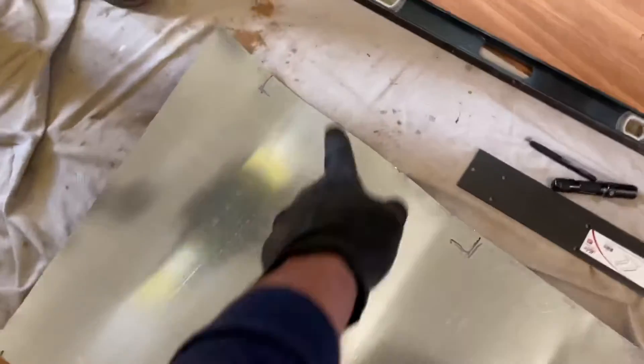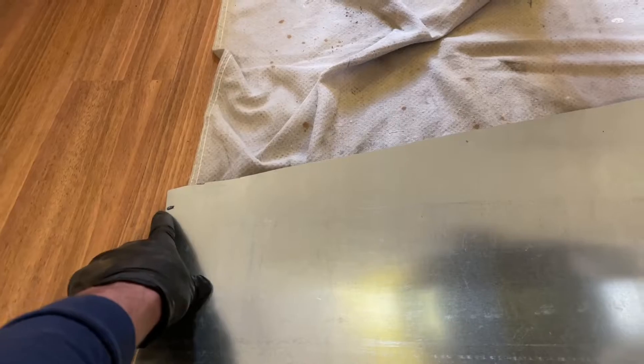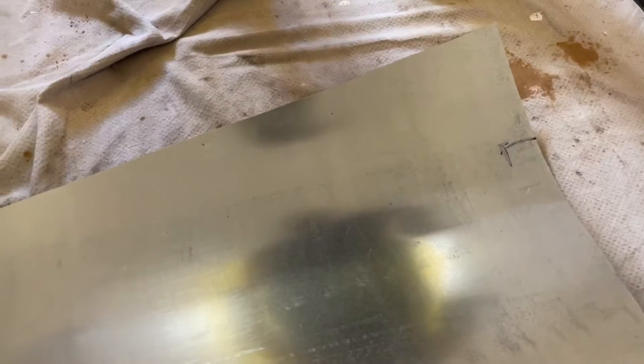So many people are probably going to be hating, but let the haters hate — I'm still making the paper. Here's a piece of sheet metal. I have some markouts here; this is my top and this is going to be the bottom. I put a one-inch flange there. Here is my mark on the bottom right-hand side of the furnace — the front right — and this is the mark on the top of the supply plenum that I have to make up to. I'm going to measure an inch off here and then cut there, and then put a flange on the opposite side as well — an inch from there — and put a one-inch flange on.